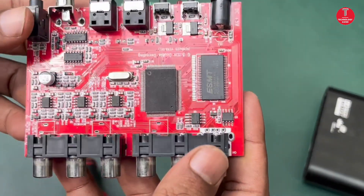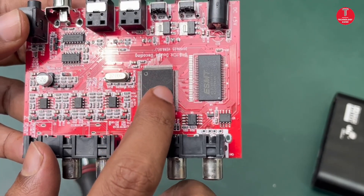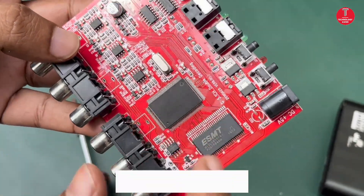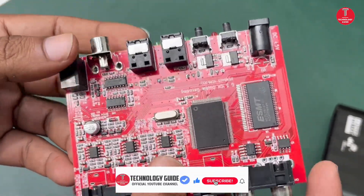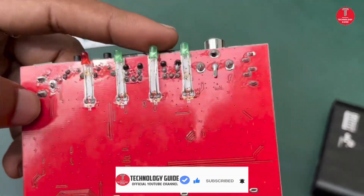You can see here the real device comes with a Dolby Digital decoder IC and a DTS decoder IC. In the fake device, both of these ICs are not present — that is the main difference affecting output quality.